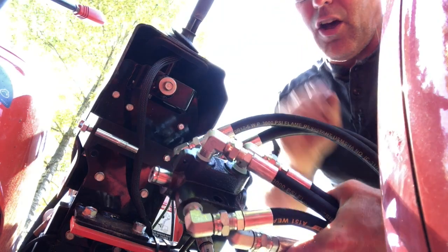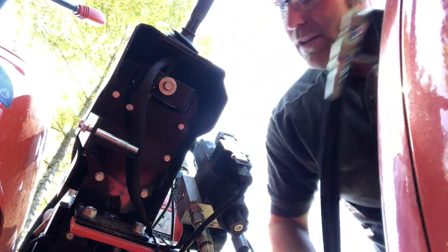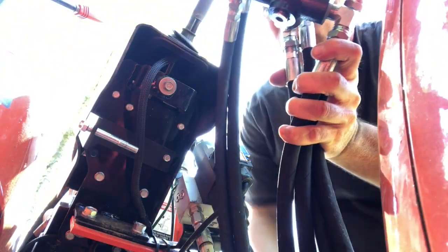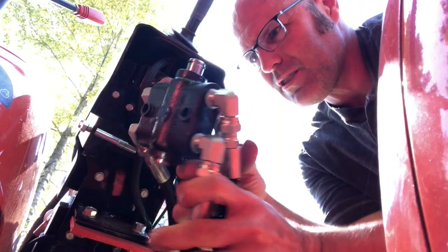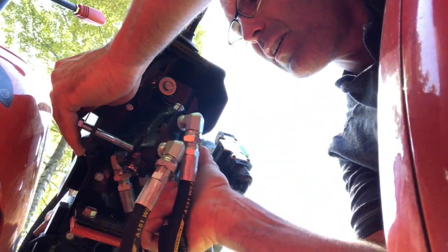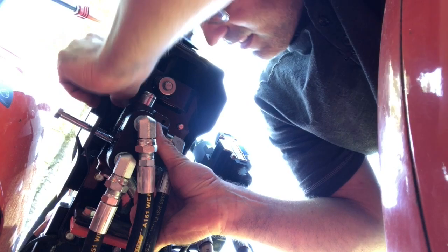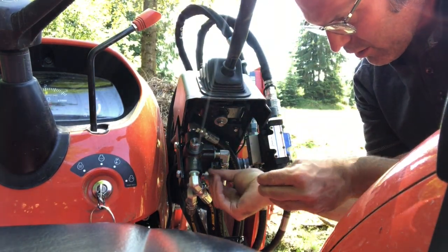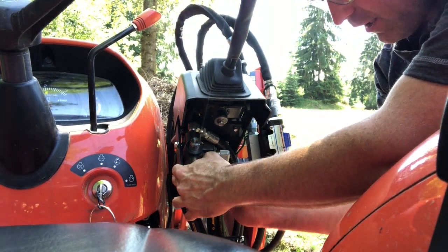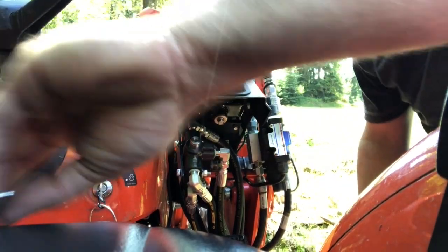I've uncurled all my hoses and all the hoses coming out of here are going to be pointing forward on the tractor. It's a little tight, so take your time and get these hoses routed neatly. Take your time and work this switching valve up here and get the bolts slid through. All the hoses are going to be up above the brake pedals and it should fit in nice and neat. I've got the hardware out of the kit — a washer, lock washer and nut to go on each one of these bolts holding the switching valve. A half inch wrench and socket will tighten this right up.